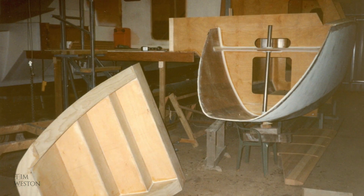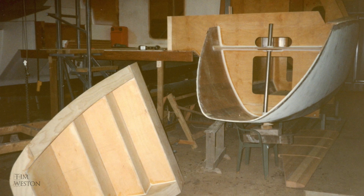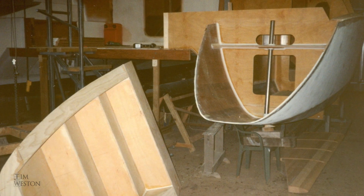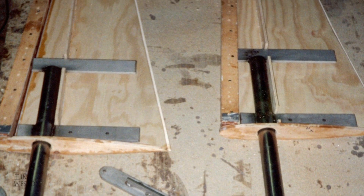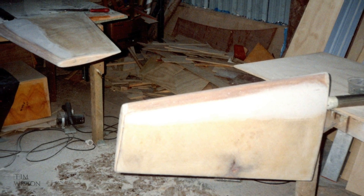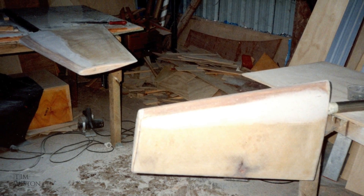The rudder shafts were solid stainless steel, which was overkill — I couldn't get any tube at the time, but they weren't going to bend. I welded stainless steel tangs under the shaft. The rudder itself was plywood construction with fibreglass on the outside. It's worth taking your time to cut a perfect foil section for your rudders and daggerboards — the foils are so important to performance, and the shape and smoothness make a big difference to the drag and thrust they produce.